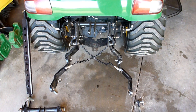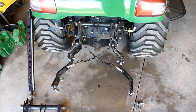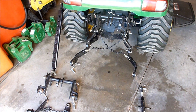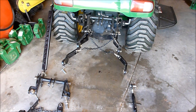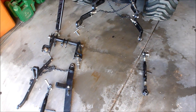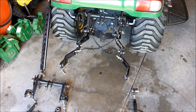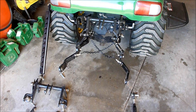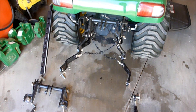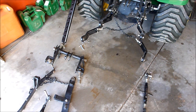You can't get a 20 or 21-inch bar in there — it just doesn't narrow up that much. That's why you can't use Category 0 implements on the Category 1 hitch. I think that's about it — kind of showing you the differences between the two hitches and why I like the Category 1 over the Category 0. I'm going to keep the Category 0 around because they don't give these things away for free, in case I ever need to switch back. Switching between the two is an absolute pain, particularly if you've got the click-and-go brackets on — you've got to take the rock shaft off and everything else. It took me about 45 minutes to switch the two. Lots of nuts and bolts that you can't really get your hands to.